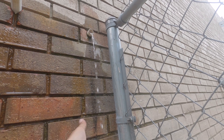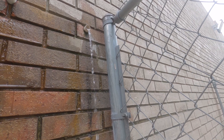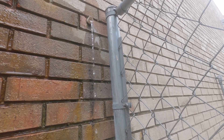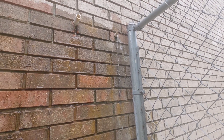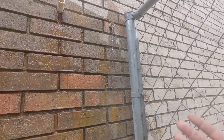That water is ice cold, and eventually — right now it's the morning time — this would have frozen up on that coil and froze the whole system up. When the system freezes up, at least in my area in my experience, it'll maintain around 80 to 81 degrees and that's about it.